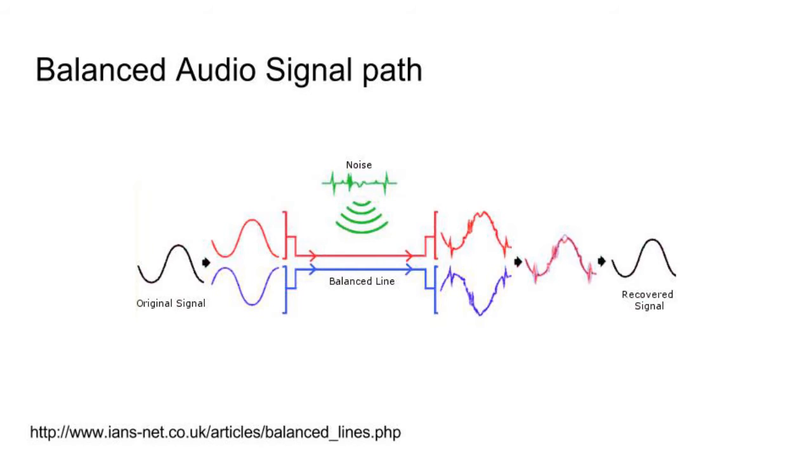What is a balanced line? A balanced line usually consists of three conductors: two carrying the signal and a shield and ground conductor. These lines are often used on professional equipment for carrying microphone and line level signals. They usually use XLR connectors or quarter-inch TRS (Tip Ring Sleeve) jack connections. In balanced lines, the shield and ground conductor does not carry any signal reference itself, so it can be left disconnected at one end to reduce ground loops. But if you have a cable with both ends connected, that's where you can use the ground switch on your DI box to isolate it.